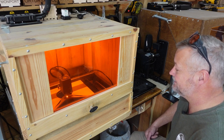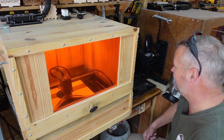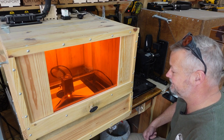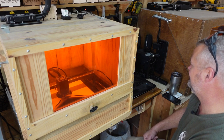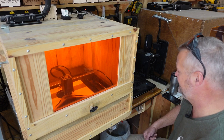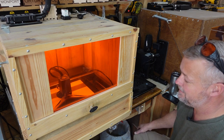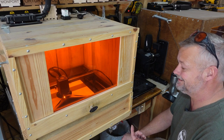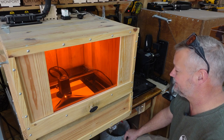I'm going to let this burn. These aren't very long burns — the lining up and orienting them and designing the graphic takes way longer than the burn itself. I'm running these at 100% power, 100 speed on the 20-watt xTool D1. I also have the LPI up to 254 because this is small text and I want as much detail as possible so it doesn't show the lines.